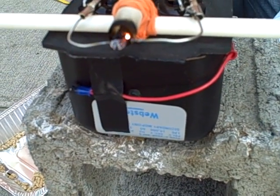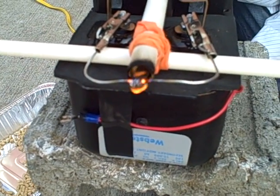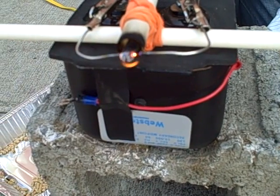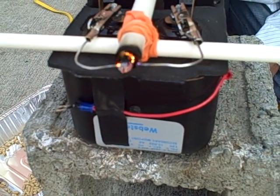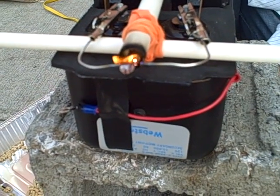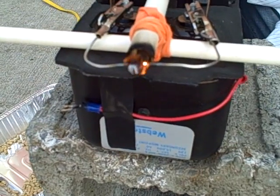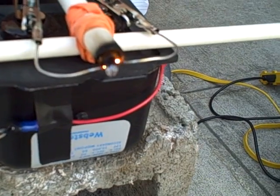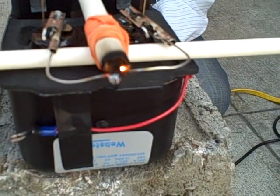This transformer is dissipating about 230 watts or so of electrical power — not a whole lot. We're just experimenting to see how much gas we might be able to get. This is an open air test right now. Eventually we'd like to do a test where the plasma arc is happening inside a vessel in an airtight environment with no air, so we wouldn't be burning off the gas. We could take the gas off through a tube and burn it in a flare at another location. But first I want to do the open air test so we can see the arc pattern and how practical this might be for gasification.